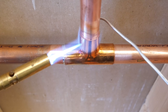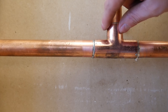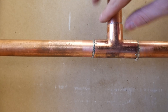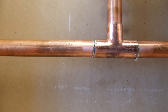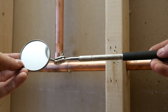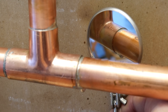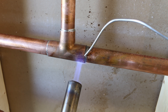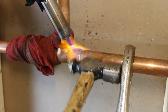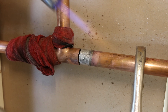And number 10 is to always inspect your joints once they've cooled down. I like taking a few minutes to visually inspect my work, as it's a lot easier and less messy to do before testing it with water. I always have one of these small inspection mirrors to check the back of the joint. If I see a spot that has no solder, the best thing to do is to dismantle it and restart — just heating it back up and adding solder will only fix the problem temporarily. I also made a full video on this, link in the description.